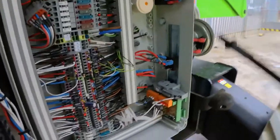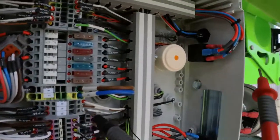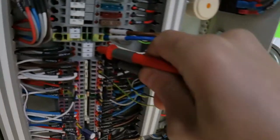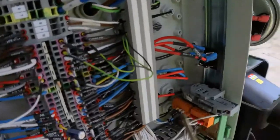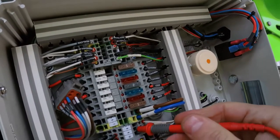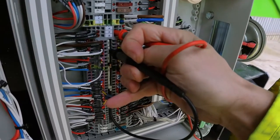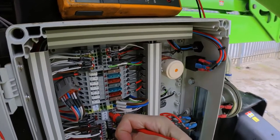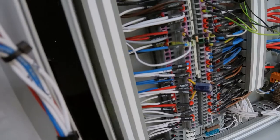I'm expecting to see about 60 ohms between CAN high and CAN low. I will measure between terminals 10 and 9. But I cannot see any resistance - measuring resistance between CAN high and CAN low and I have 20 mega-ohms. So I have no termination at all - that's very strange.